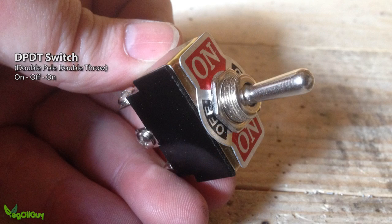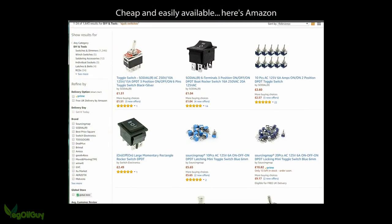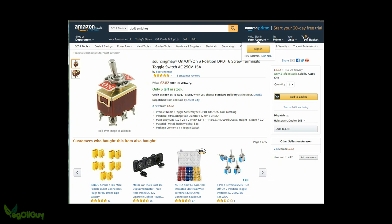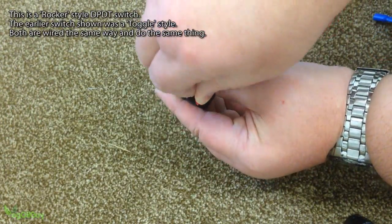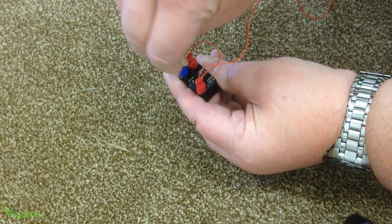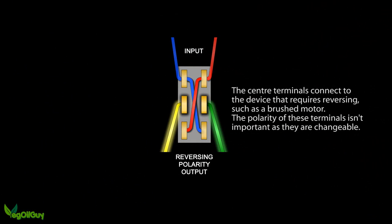What's needed are switches like this. They're called DPDT switches, which stands for Double Pole Double Throw. The great thing about these cheap, easily affordable switches is that they can reverse the polarity — they can do all that wire swapping for you. To achieve this, you need to wire the switches up in a particular way. Here you are looking at the underside of the switch where the terminals are. Look at the way the red and blue wires cross over each other and connect all the end terminals. As long as you remember that simple cross, you can wire up one of these switches. The positive from the battery goes to one end terminal and then it's joined to the opposite end terminal. The same thing happens with the negative. This achieves the crossover, and it really helps to think of this as the reversing part. The two remaining centre terminals connect to the device that needs powering, such as the motors on my Caterpillar tracks.